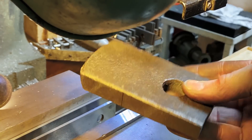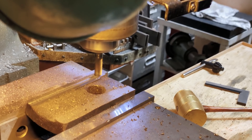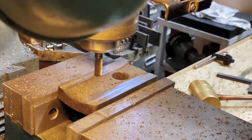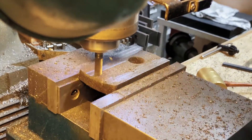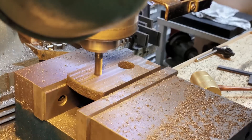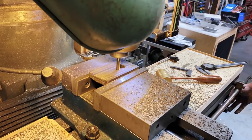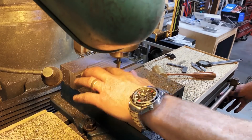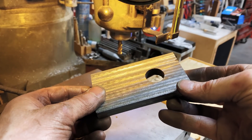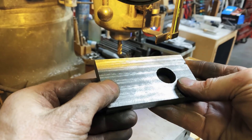This is a nice big fat chunk. I discovered the glory of carbide bits while milling cast iron. High-speed steel doesn't do quite as well and can tend to spark, but carbide eats this stuff for breakfast. You can see all the iron dust all over the table — that iron dust gets absolutely everywhere and it can really mess up your machines. So you want to cover up the ways and the mechanics of your machines as best you can and clean regularly. I was vacuuming up probably three times a day. But look at that gorgeous piece — when I put my finger over it, it just feels like a perfectly flat piece of metal.